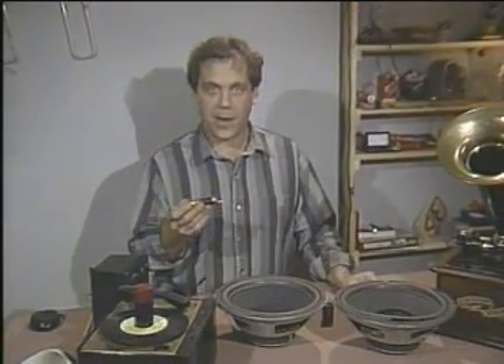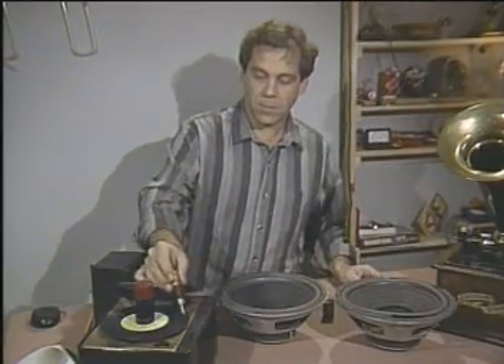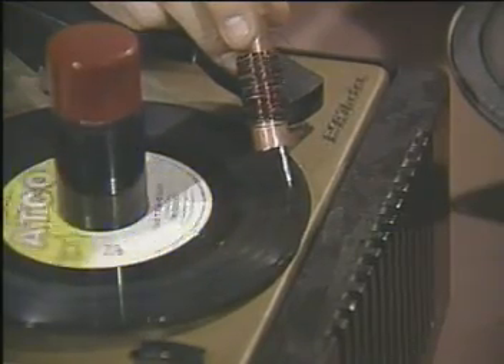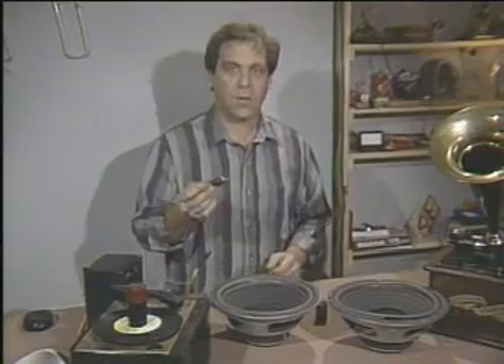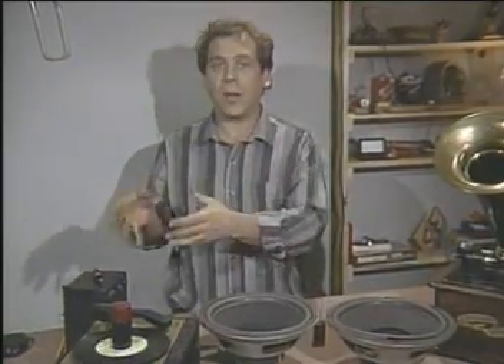For viewers who think the props on Acme School are just a little funky and that a piece of copper pipe and a nail have nothing to do with a real phono cartridge — this is a mono pickup. Stereo uses two pickup coils mounted at 90 degrees to each other. This phonograph cartridge will also work backwards: if I feed it a wiggling electric current, the needle will wiggle along with it.